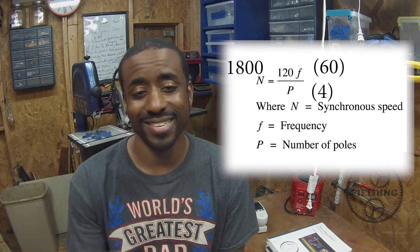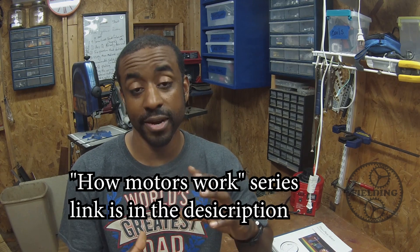The speed of an induction motor is based on line frequency. Line frequency here in the U.S. is 60 hertz; many places in Europe it's 50 hertz. That, in combination with the number of poles the motor has, determines its speed. A four-pole motor at 60 hertz will run just under 1800 RPM. The motor has to slip a little bit — if the rotor catches up with the spinning magnetic field, there's no more relative motion and no force on the shaft, so it begins to lag behind. This is called slip speed, and it's generally about 1750, between 1700 and just under 1800 RPM.